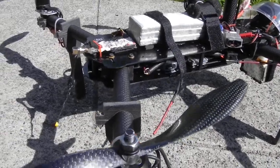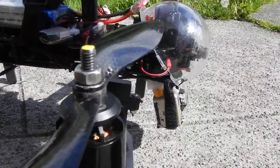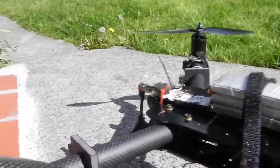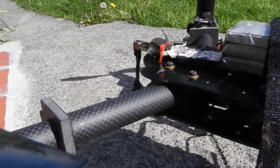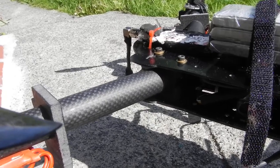We've got good GPS hold today. I modified it to protect the GPS signal from the 1.3 gigahertz antenna on the back, pushing 700 milliwatts — probably 500 actually, but 700 listed.